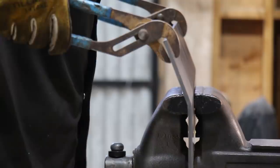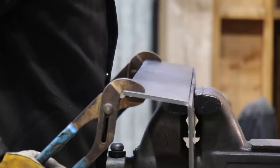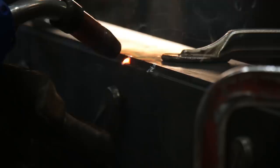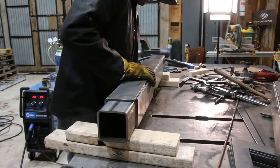I had some four-inch square tubing that I'm using as the inner piece that the bottle jack will sit on, but I didn't have anything that this would slide into, so I decided I was going to have to fabricate the outer sleeve. I cut out two sides of the sleeve that could be bent and molded into a 90, using the four-inch inner piece as a form. Then I loosely held the two halves together while I welded them, which ended up giving a nice snug fit but still letting them slide within each other.